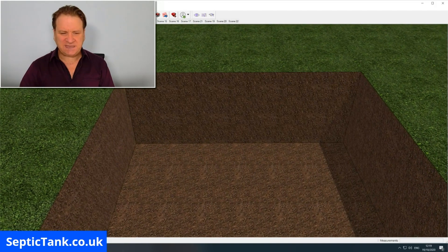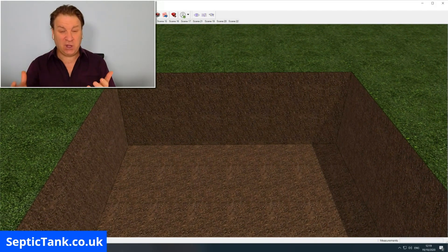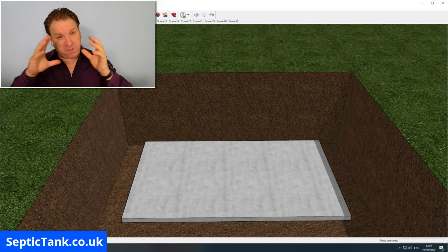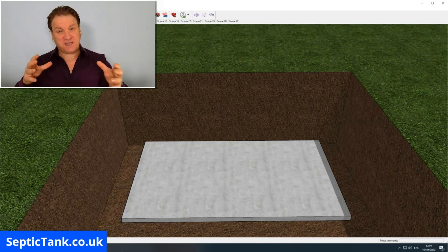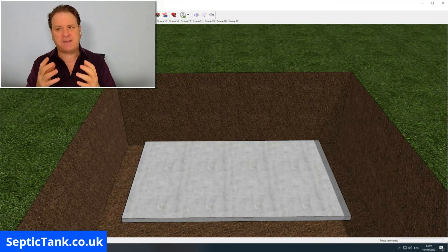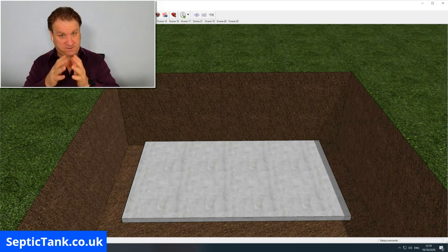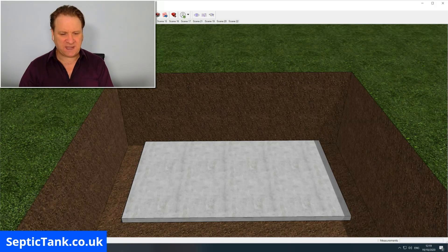The first thing you need to do is dig a hole. Once you've done that, you put your concrete base at the bottom of the hole. You can buy these pre-made — the different sections — and just bolt them together, or you can create a frame, a template, a kind of mold to pour the concrete into, and then when it's set you have your different sections. It's up to you how you go about that, but these are the stages of the septic tank construction.